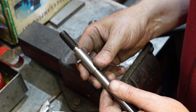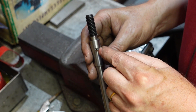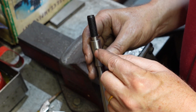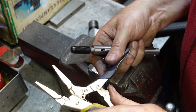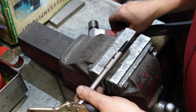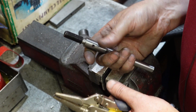Here's my handle - I've got a high-tensile bolt turned down for a close fit, some Loctite in there, and now I'll put a roll pin in and dress that off. I just thought I'd mention I used to have a lot of trouble getting roll pins started in the hole - a roll pin is sometimes called a spring pin too. This is a four-millimeter hole, and that measures 4.5 millimeters. What I worked out was that if you compress the end with a set of vice grips, that squashes it down well enough so you can just start it with a hammer. Once it's started it gets a lot easier. That's just a little trick for setting spring pins.